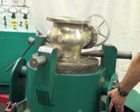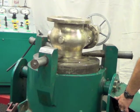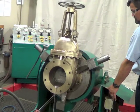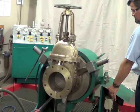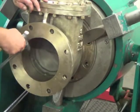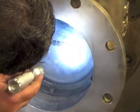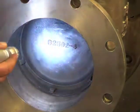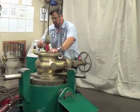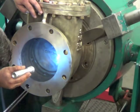Next come the two seat tests for each port side of the valve. The inspector fills the open valve with water and then closes the gate. After removing excess water, the valve is pressurized up to 225 psi and inspected for leaks within the waterway. Although our testing specs, MSS SP80, allows for a 10cc per inch per hour leak rate, this side of the valve is completely dry. He repeats the process on the other side with the same successful result. Our valve has passed the hydro test.